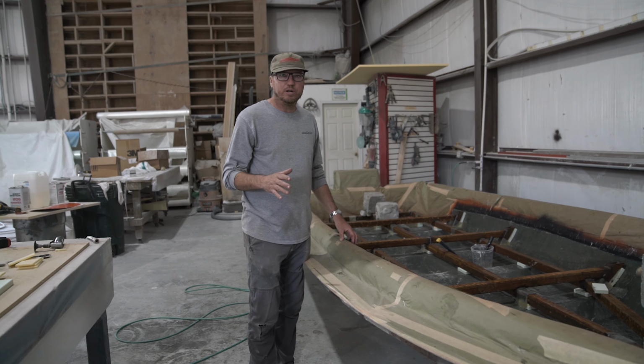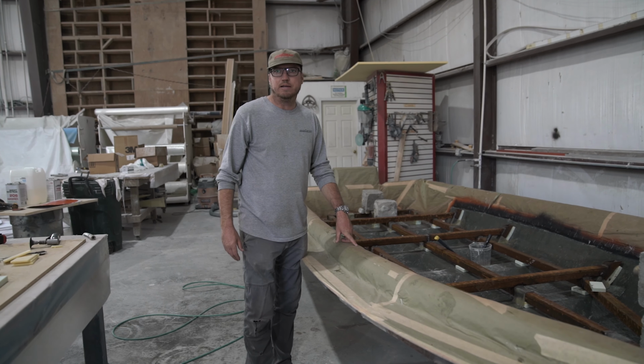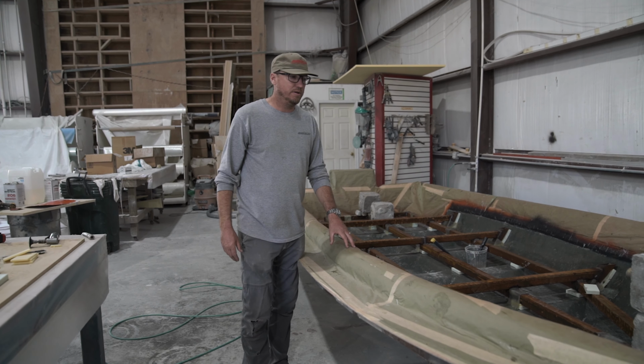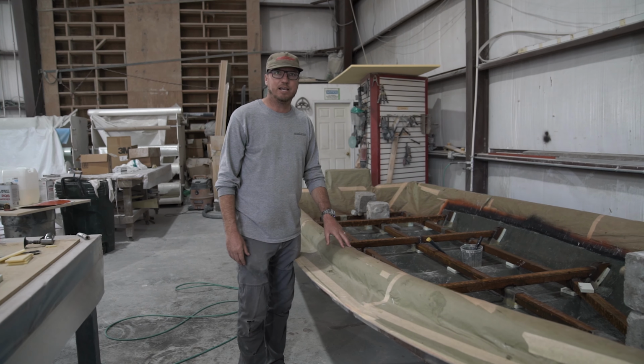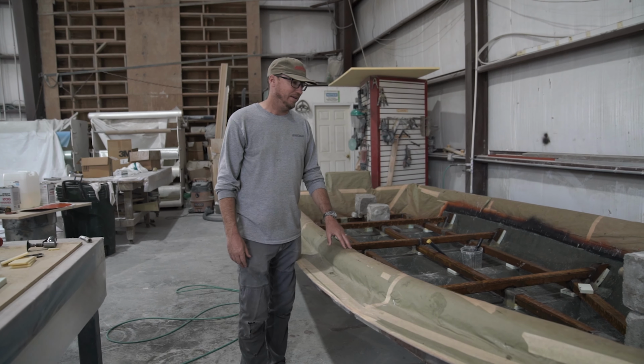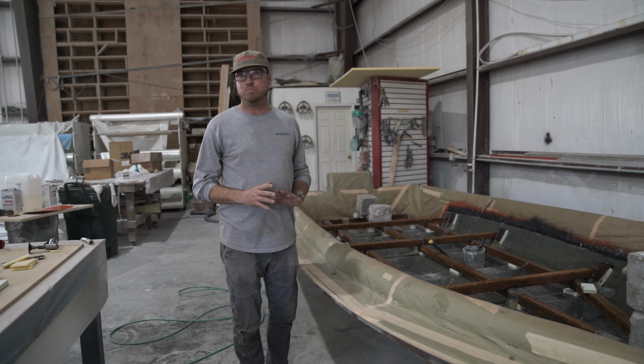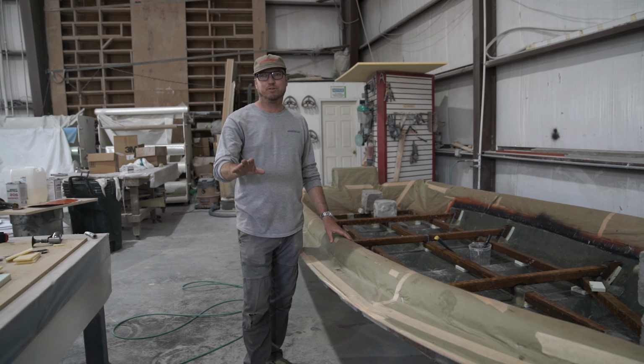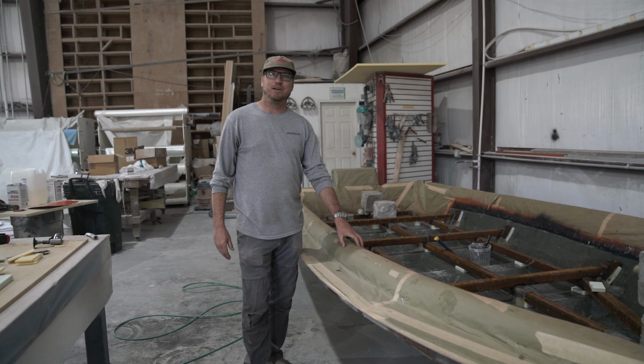Estimating that to weigh around 20 pounds, this hull right now, based on calculations, was designed to be 142 pounds, and it actually came out to be 145 pounds. And that is unbonded, no structures and no bulkheads. But yeah, we're gonna hit our goal weights. I'm not gonna tell you what those are, but our hull does only weigh less than 150 pounds without the stringer grid on it, with a 20-pound stringer grid. And our deck might weigh under 50 pounds. So y'all can do some math there and see what weights we're coming out to.